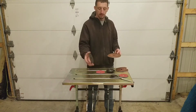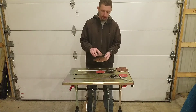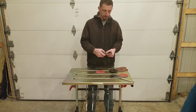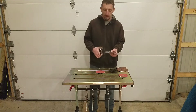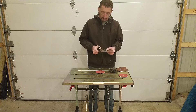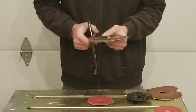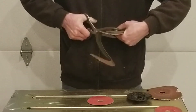The tip is: I use a lot of five inch materials in the shop for my grinder, but if you take a five inch wheel along the seven inch pad, use the collar as a template. Take a good pair of scissors — granted you will wear out your scissors over time — and use the template on top to essentially cut all of the bad burned material off the edge.